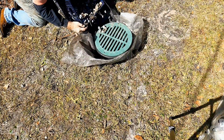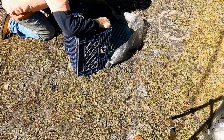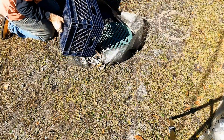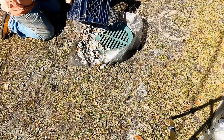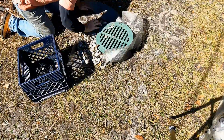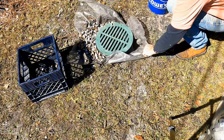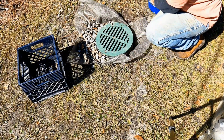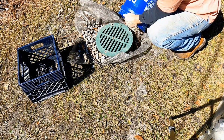Vertical drainage. This is much more cost effective than putting in a French drain or catch basins. Vertical drainage allows that water to go down into the ground and soak away. As I researched all these videos from Finland, I noticed that what they're really doing is they're transferring the flood that's on top of the ground down underground. By giving it a chamber with lots of gravel, they're transferring that flood down underground. This allows the water to be soaked up by the subsurface soil.